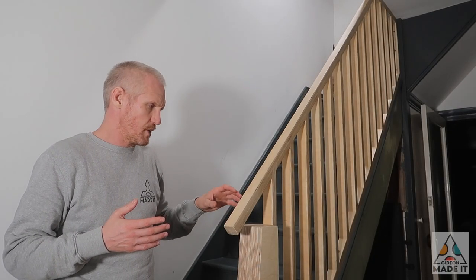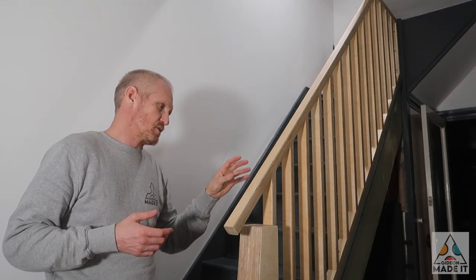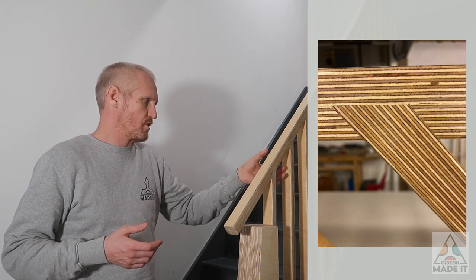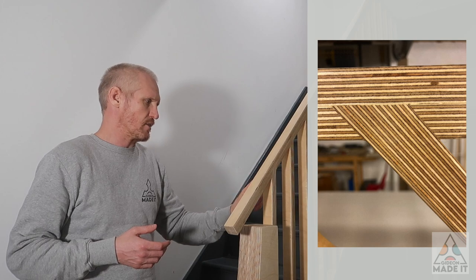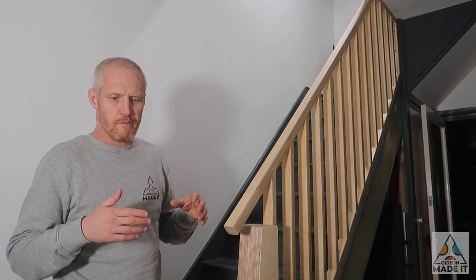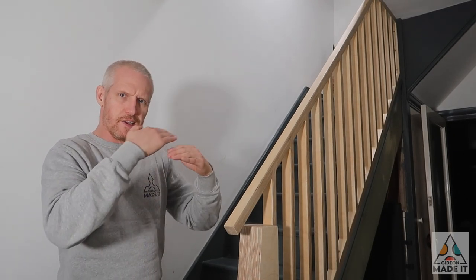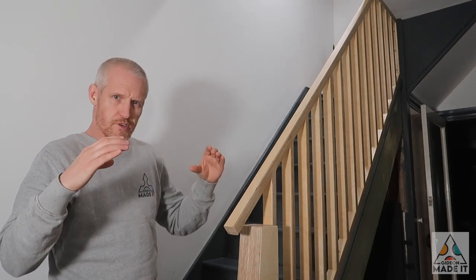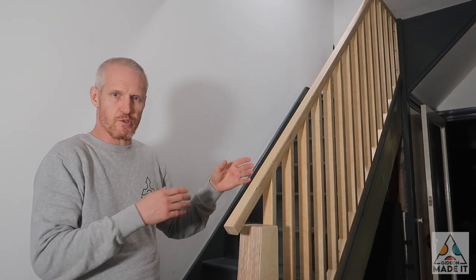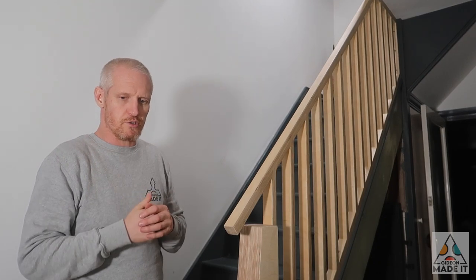The construction wasn't that complicated, but the thing I think people find most useful is the angled dado joint. The way I did it is by stacking the outer frame with the spacers, which creates the perfect angle for the spindles to slot in. I got the idea from watching a Paul Sellers video where he made a workbench — I'll put a link in the description. The principle is that stacking layers of plywood gives extra strength and creates very strong joints without requiring traditional, more advanced joinery.